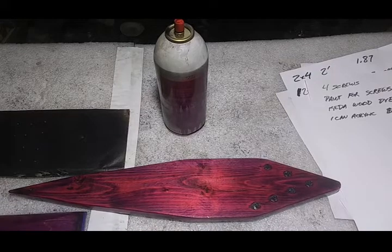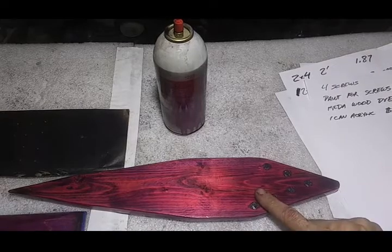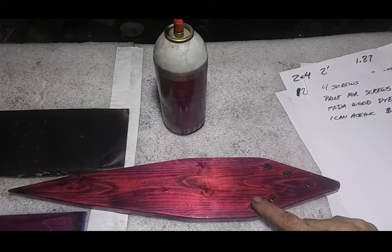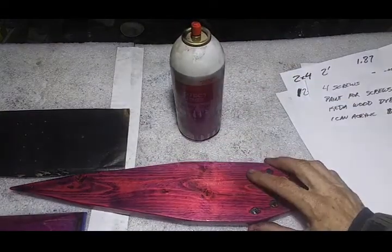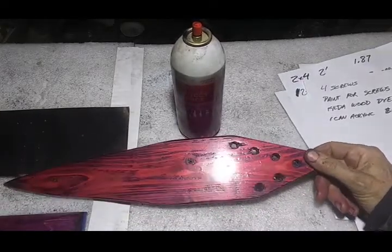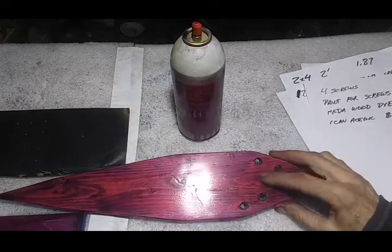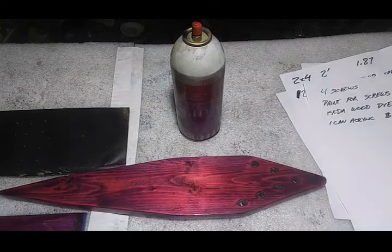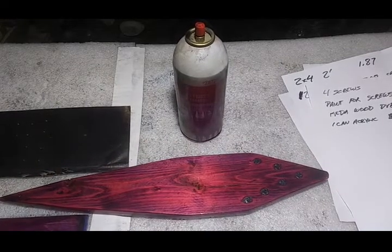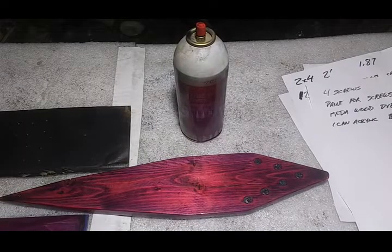So let's see, hanging it over the heater, it's going to need 2 rounds of dyeing. You can do that in about 30 to 45 minutes, including drying time for both rounds. And then perhaps, depending on if I want to finish more or less identical to this, I'd have to go 4 coats of acrylic, but maybe I could get away with fewer and get pretty decent results. Might get away with like 3 and pretty much reproduce this look, so see how it goes. And for coats, I'm looking at maybe 30 minutes drying time at most for a coat, if I'm putting it over near the heater, not right over the heater. I don't want to bake and bubble any of them.